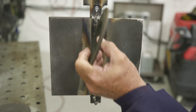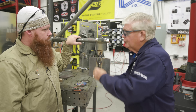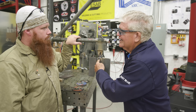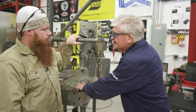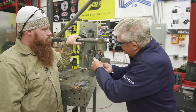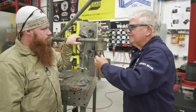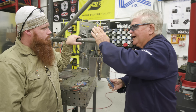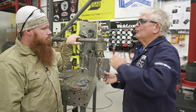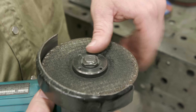In reality, you take the eighth inch wheel, turn the grinder a little bit so you're riding on the bevel just outside of the weld, and scoop it out. Because you've got the wheel turned, you'll wind up with a wider face. In this case you're going to pull — not push — because you want control. If you push, you'll keep falling into the weld. So you pull it, take the crown off the bad spot, work a little farther down, open it up, and now you've got a nice shallow bed to lay in your other weld passes. That's what the eighth inch wheel is for.